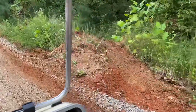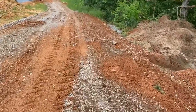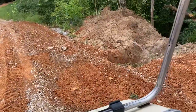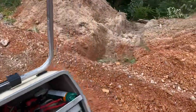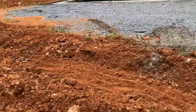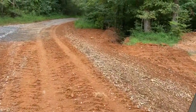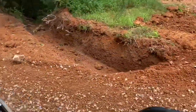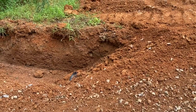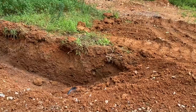Gave it another exit there and then it goes off. Just kind of smooth this out a little bit - it's kind of a hump, gotta drive over it a few hundred times and run the box blade across it again. This is where the first culvert went in. We're gonna put about another six inches of stone on top here. We've got a pretty good water canal already dug there, widened it out a little, and that's going to head into the culvert and dumps out on the other side. It's more than two feet down - it only needed to be 16 inches - but it's way down in there. That whole trench is about three feet deep and the pipe is 12 inches tall.